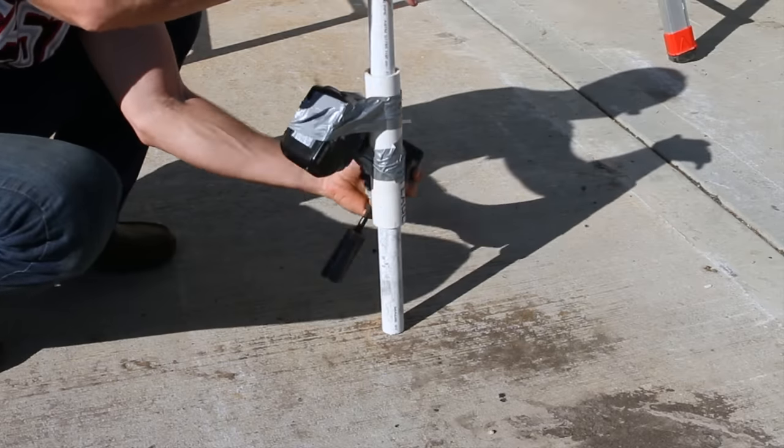The red Makita is on the left and the blue is on the right. The controller boards actually look quite a bit different from each other. Even the rotor pinions were built using a different process. The hammer cases are also quite a bit different. A flathead screwdriver is all you need to pry open the hammer case on the red Makita. The blue Makita is left-hand threaded.